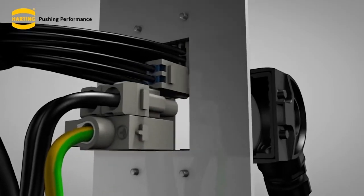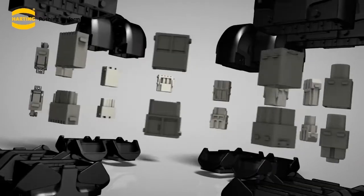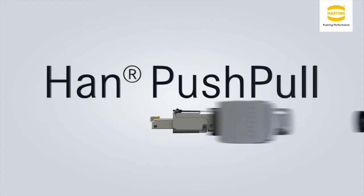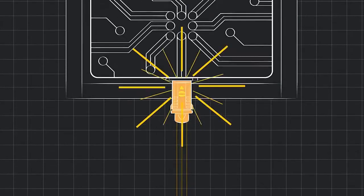For the electrical distribution we use the Han EcoConnector for all the interconnecting connectivity within the unit. For the communication signals that we use for fans, we use the Harting push-pull with pre-link to make all the command signals for our different analog devices.